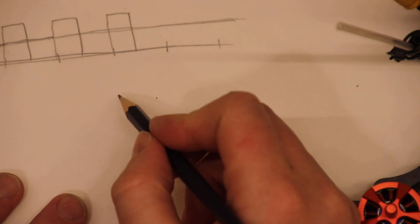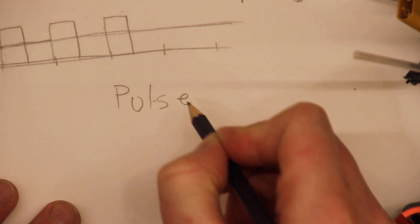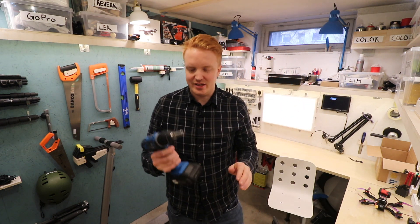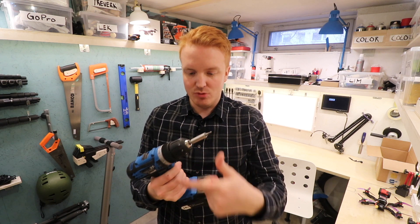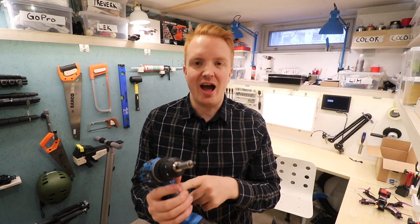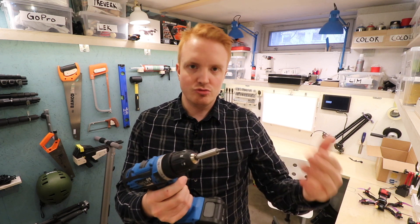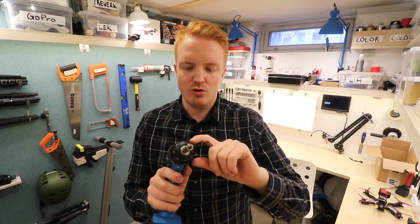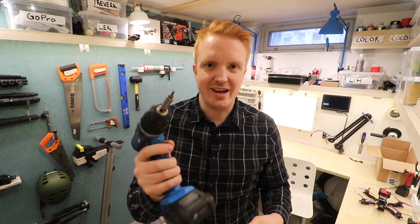I should correct myself — I kept saying 'post width modulation' but it's actually Pulse Width Modulation. So that's why I find this so interesting: now we know that anything with an electric motor and DC power needs an ESC, which uses Pulse Width Modulation to regulate speed, and uses an H-bridge to change direction from forward to backward. That was it — thanks for watching.